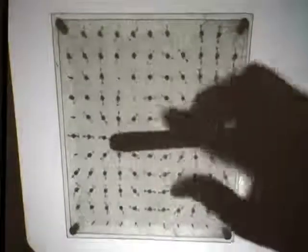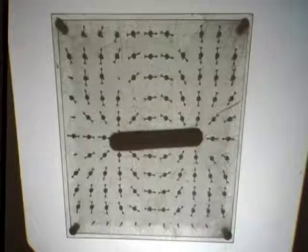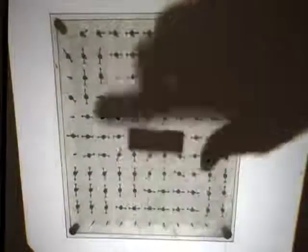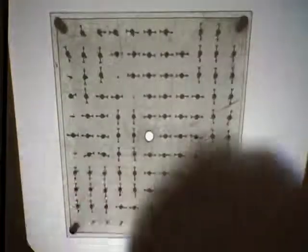If you put it right on top, can you visualize the magnetic field lines? See how they're north and the south, and they go one direction? So from your perspective, which side's north? The left. Because the magnetic field lines are coming out the north and around over to the south, through the magnet and back out. A horseshoe magnet, same. It's not as strong as the other one. Let's do it this way. But you get the same idea. All magnets have poles and do that.